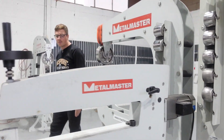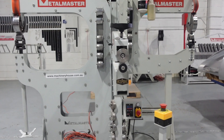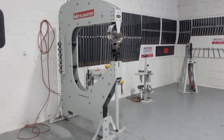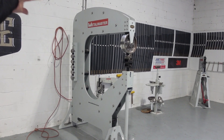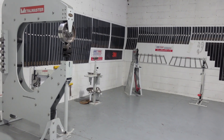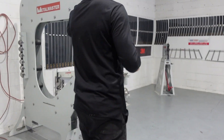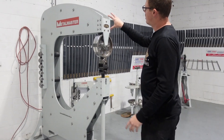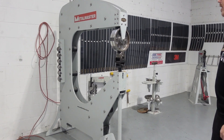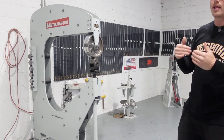Just a standard sort of bead roller with all the dies. This was a new prototype again — this is the bigger English wheel and this done the other half of the Auburn. This one's got a meter throat and a bigger cutaway in the bottom, so it's really great for getting certain panel shapes into it. They've since made an adjustment where you can actually unbolt this and flip it around 90 degrees, so you can get like a motorcycle tank or something like that in there — just something I said to them would be handy to get that little bit of extra access.